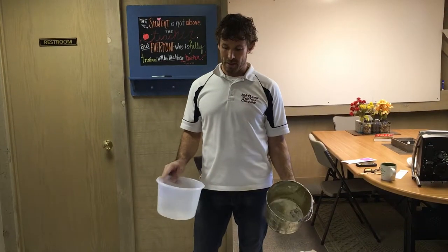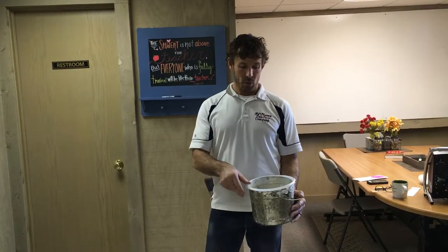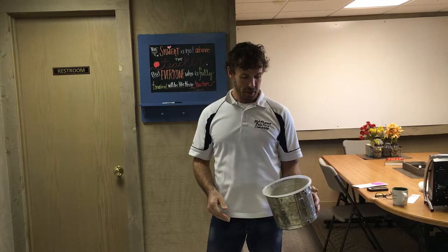The reason we like these is that we can get these liners — they sit right in the bucket like that. And if we have several colors going on throughout a house, we can just pull that out, put another liner in, and then keep going. It's also a way to keep your bucket fairly clean.